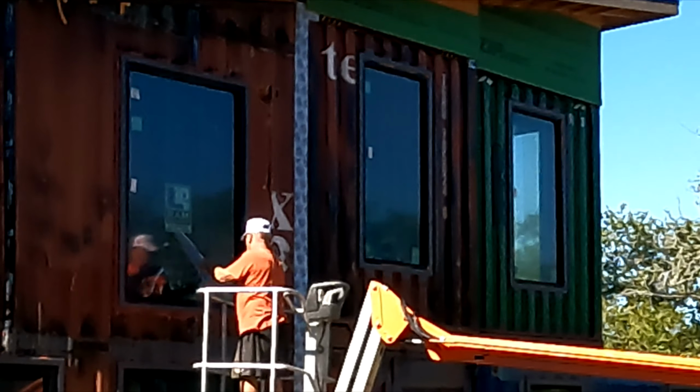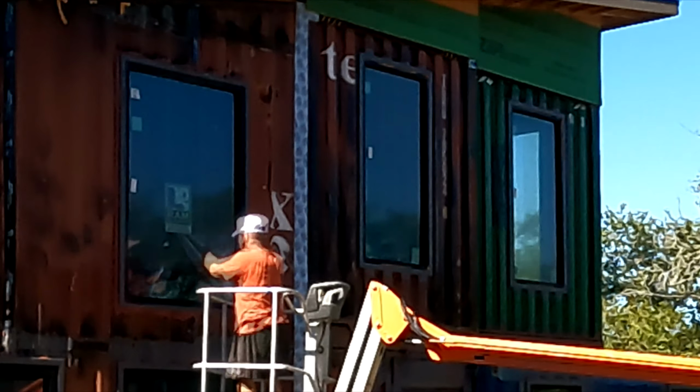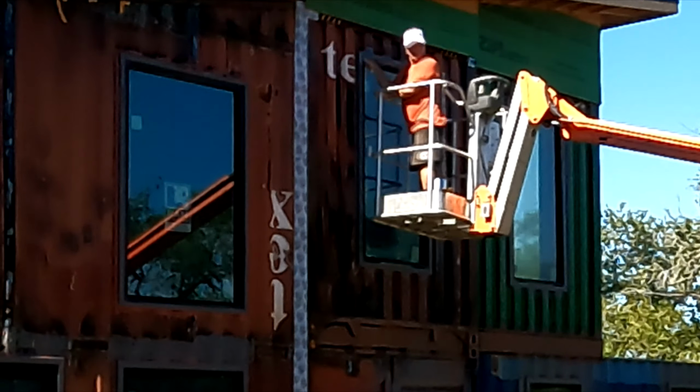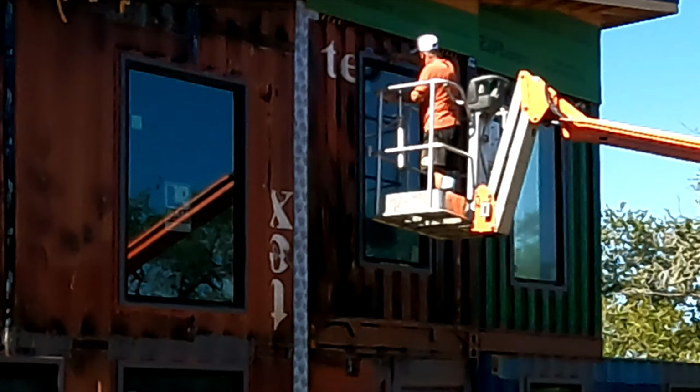We're going to do it on the rest of the windows on the outside, since we're getting basically an outside metal covering, our panel work, similar to the roof, at a later time. We've still got to put 2 doors in and stuff like that to make that happen. And I still have to work on the deck over the master before that happens. But here you see me doing the other windows high up there. These were done about 6 months ago, and the closed cell foam was good enough to keep the water out, and the sealant should do the final trick and make it weatherproof totally. Anyway, it was pretty straightforward.